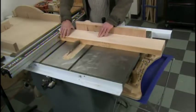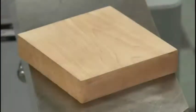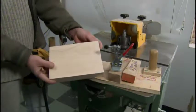It takes up to 28 steps to make a utensil. First, a worker planes a maple plank to a specific thickness. Then they cut it into blocks the length of the utensil, in this case a fork. The worker places each block on a curved template and traces the curve, which matches the arc of the fork's handle.